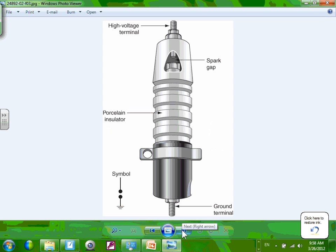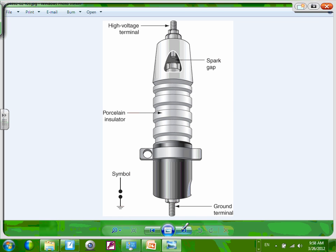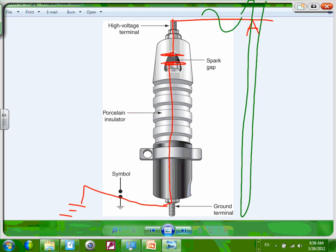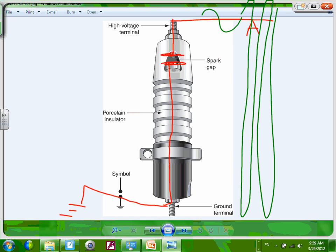Lightning arresters, guys. What they do is they take phase A here and take this to the ground, literally, with a spark gap sitting right in here. So here's what they do. If there's lightning, look at this. If the voltage here is nice and sinusoidal, right? No problem. The minute that this voltage goes way up and comes down and back up again, what's happening here?